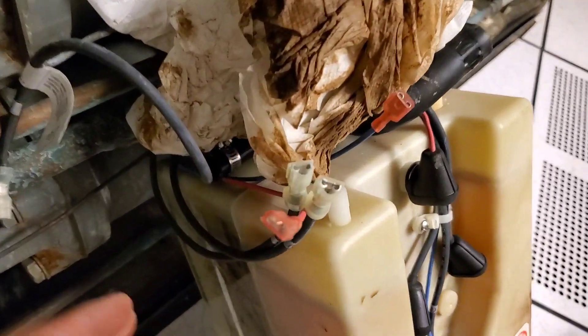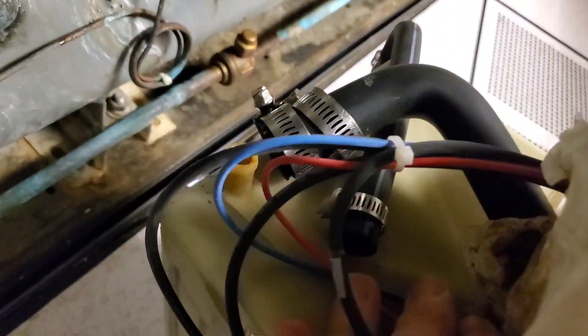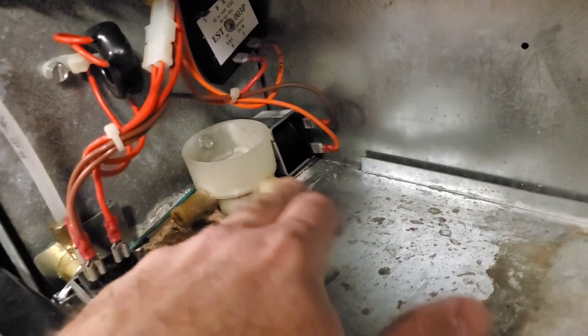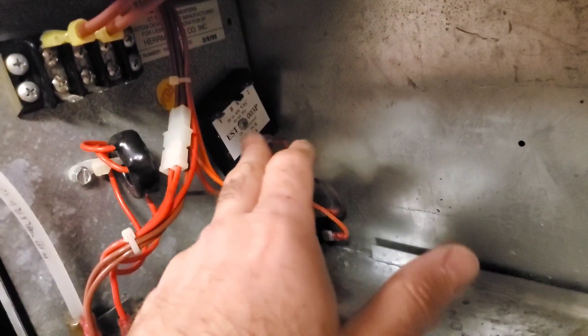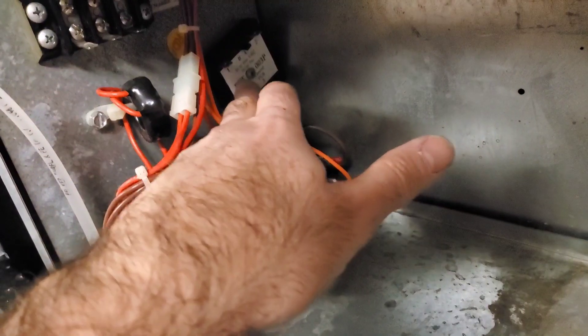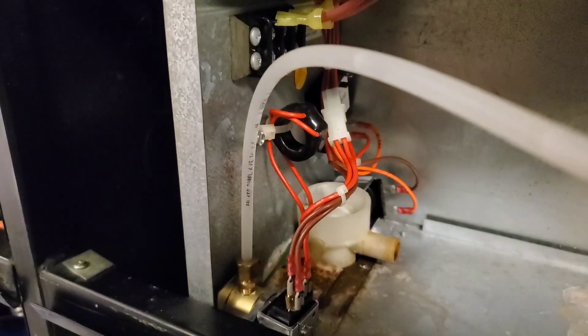When you're pulling out the drain tubing, which is down here, be careful — because even though I got most of the water out, there's still a little bit in there and it kind of splashed back and got me. While we have the cylinder out, I'll show you a couple of things inside: this is your drain cup, this is your drain solenoid, we have our overfill interface — basically if the cylinder gets too full, this is gonna send it into an alarm — and right here is your CT, your current transformer, which measures the current of the heater embedded inside of the cylinder.